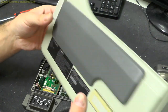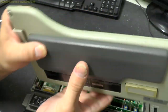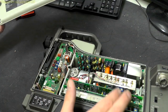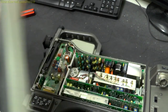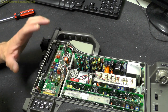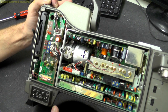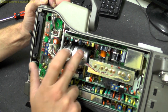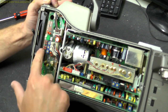Similar story with that panel — a nice rubbery squishy side panel to rest against the side of your head when using it. There are a couple of little access panels to reach some controls inside. One is a filter giving access to the white balance adjustment wheel on the inside. On this side we can see one of the Saticon tubes mounted inside, another disappearing up into part of the handle, and one coming down here.